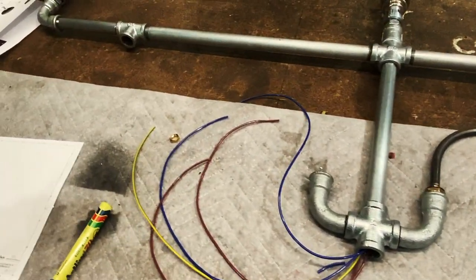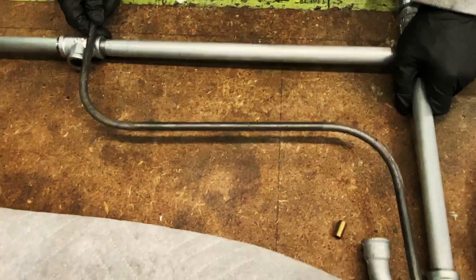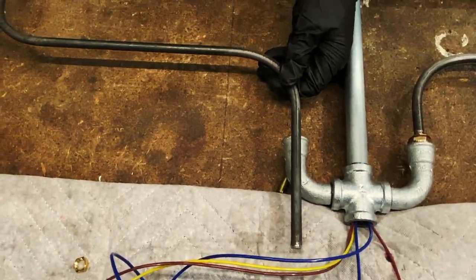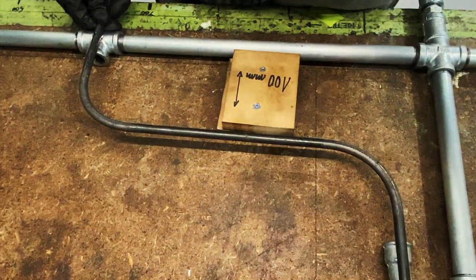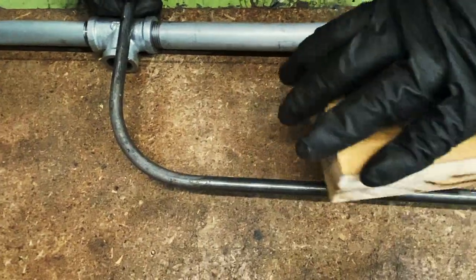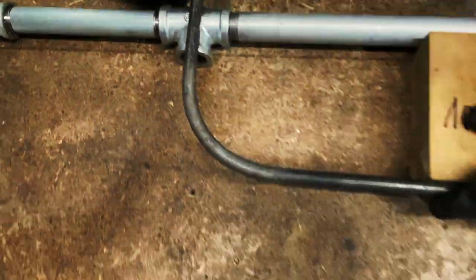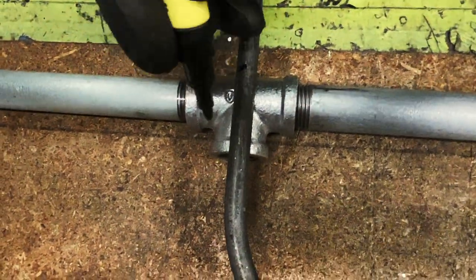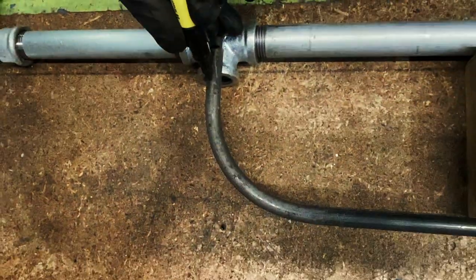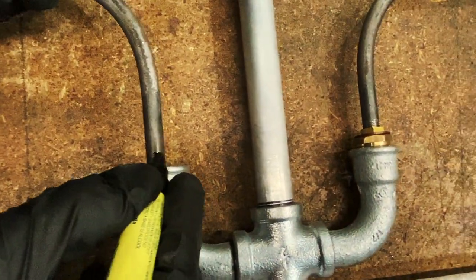Now we have a look at it on the light using a jig - another little jig. That's our upside-down measurement. We're lining these up with the centre of the pipe on both sides. It's pretty good - that will go if we force it. We mark it where it goes inside the pipe, and that's where we're going to thread it.